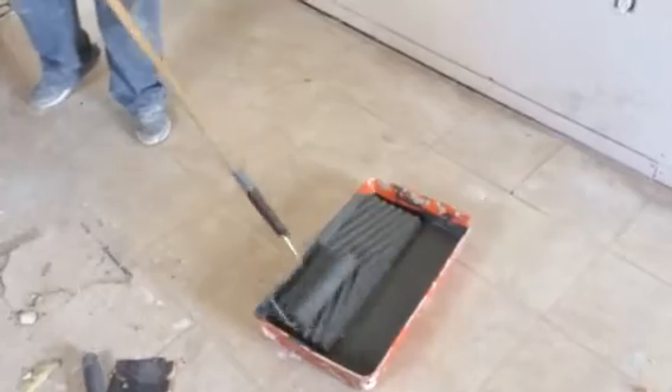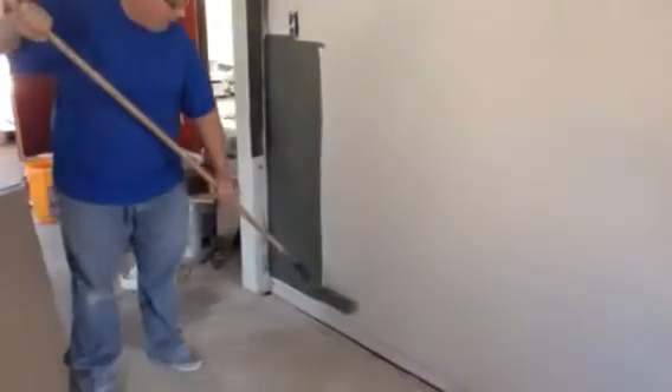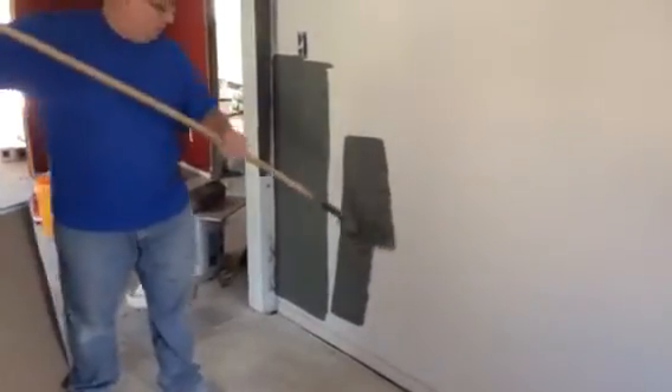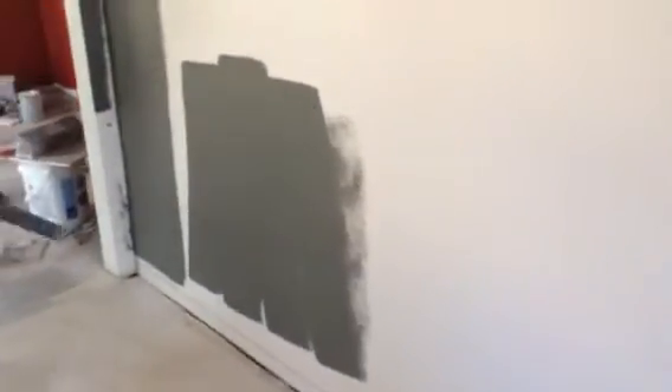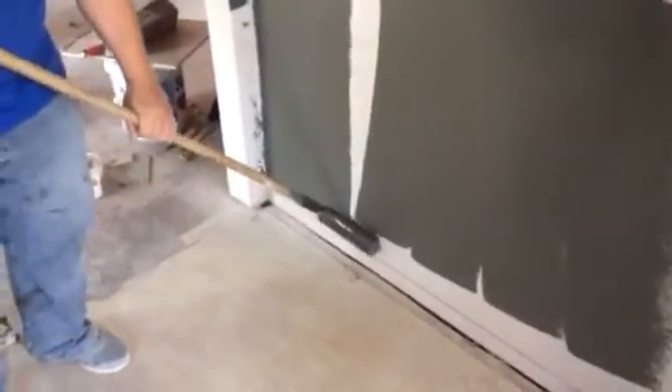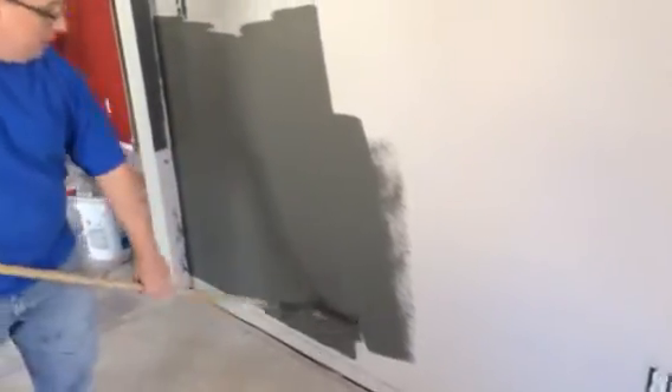So now I'm going to show you why it's important that you apply pressure in the proper direction. I've got paint on there. If I'm rolling the opposite direction, we've got buildup right here — can you see that? There's the buildup. Because I'm applying pressure on this side but rolling that way, the only way to avoid that is to roll into the pressure. I'm applying pressure to the right side of the roller as I go, and it's going to cover up and take care of any of those lines.